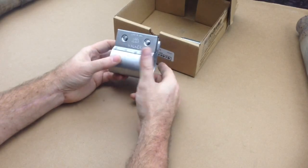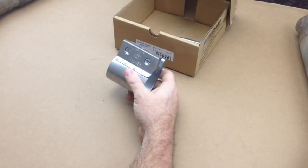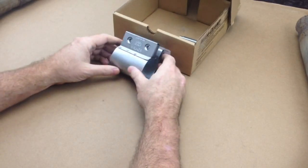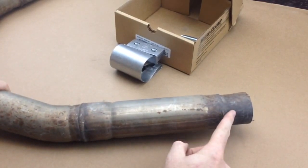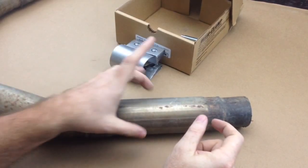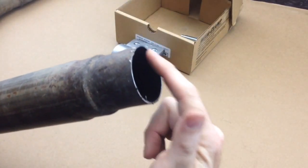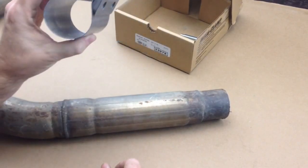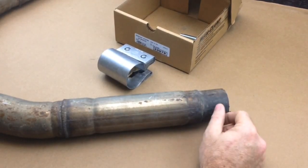You can also get polished stainless steel or ceramic coated black ones — just whatever you want. Now for sizing: almost all BMWs have two-inch pipe, but there are certain points even on the six-cylinder cars where the pipe steps up or down, so you can't always measure it easily. You can measure the outside diameter with a caliper, or you have to wait until you cut it and measure across the end. You definitely don't want it too small, and too big is actually worse than too small.